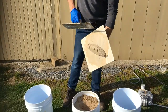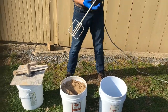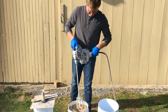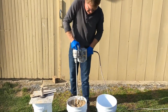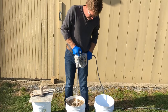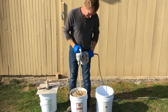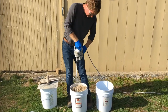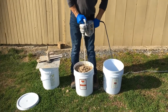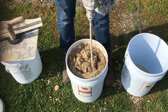To knock up a whole bucket, I use one of these egg-beater type attachments on a right-angle heavy-duty drill. Stick it in — it doesn't go easily because the material is so compact when you first open the bucket. Start at the top, turn it on, and start mixing, working your way down a little at a time. If you look carefully, it's already getting softer.